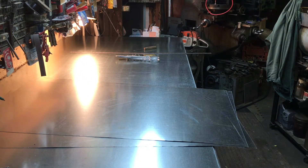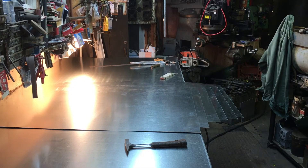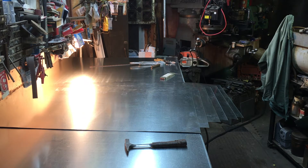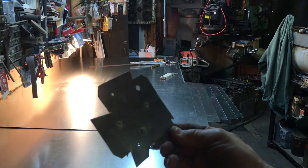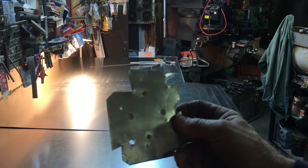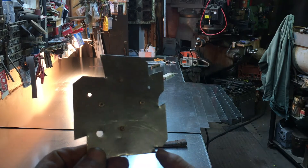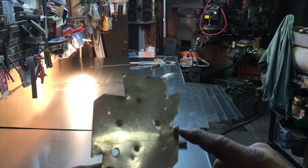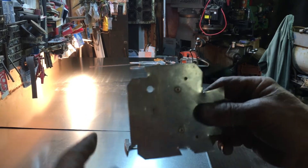There's the first three of the cutting — 12 are required for this particular size of duct. I went ahead and cut six raw sheets because it's much easier to do six at a time instead of 12. Now I'll show you how we notch everything for the fold on the duct. You don't want to notch everything with a ruler and tape measure because it's just too time consuming. If you can find a scrap piece of light-gauge stainless steel, you can make a scribe template. I put notches at a quarter inch, half, three-quarter, one inch, and also three-eighths into the side.